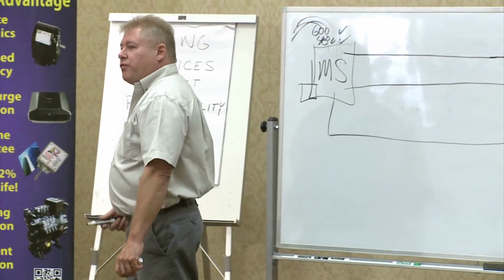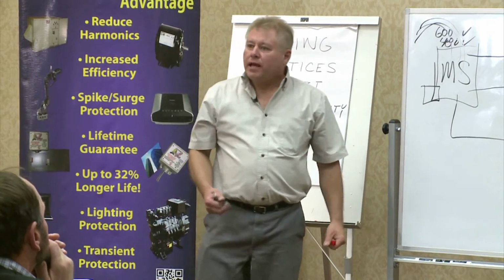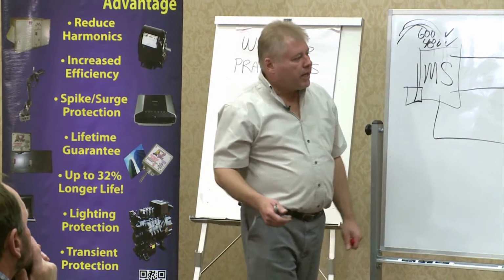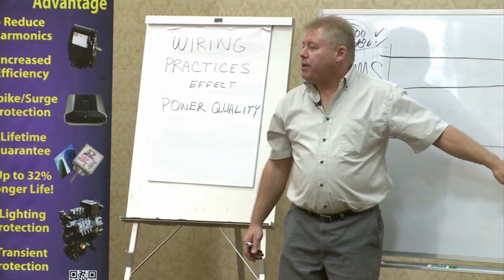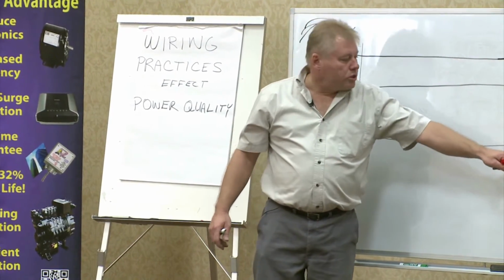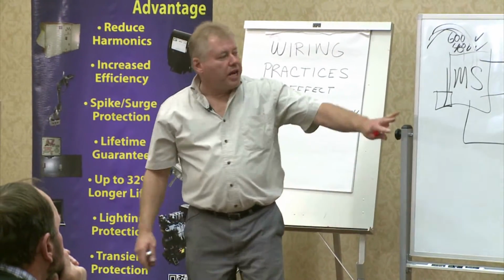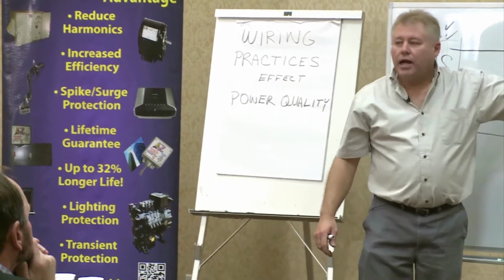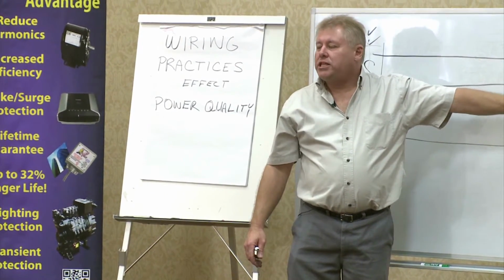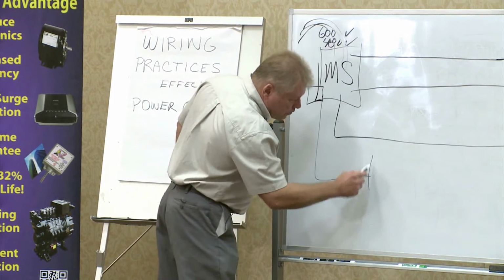You're giving a chance for your motor, your inductive load, to act like it's on its own and get back to its natural power factor. You're not allowing it to be surged by electronic devices, the harmonics being produced, and that harmonic effect causing those current surges. All those small current surges, which are affecting the top part of the waveform, are now being gleaned off. Now everything has a chance to settle down. You're policing everything. Then, from there, of course, you've got your transformer.